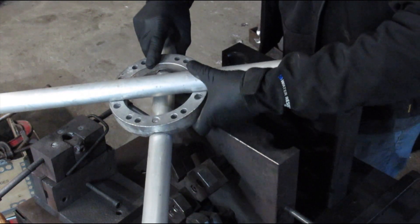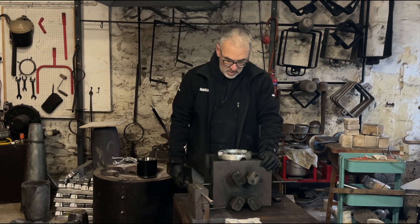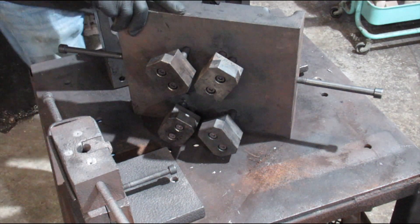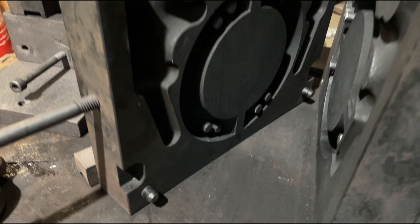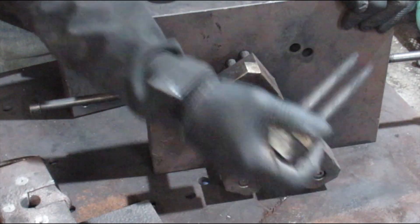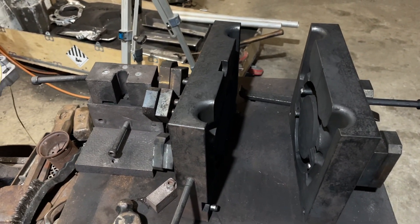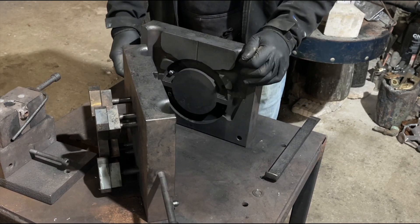So how are we doing that with this aluminium and this mold? These are made of steel and we've got the pattern split down the middle. We've got these pins that are retractable — two pins on each side, two pins there — they make the holes. Basically when it comes to this, it really needs a lot of heat. These moulds need a lot of preheat.